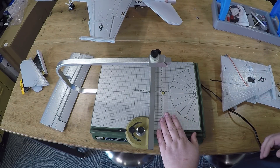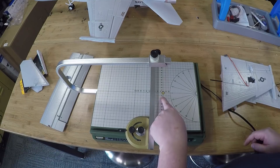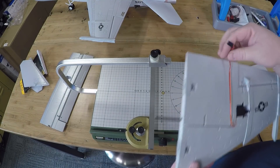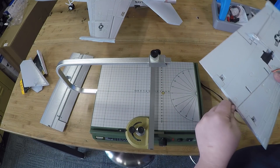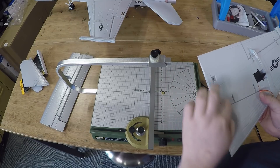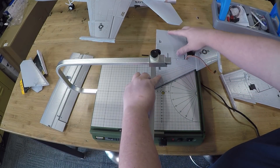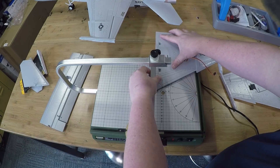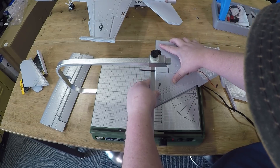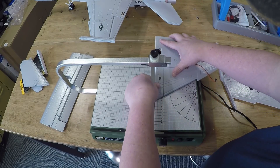The foam cutter is set up running almost exactly 30 millimeters off our center line. I've gone ahead and pulled the servo lead out. The carbon fiber spar is really securely in there — I'm going to use that to my advantage later. We're going to have to do a couple cuts. We'll keep it flat against the fence and just let our carbon fiber rods skirt across the top. There we go — a nice clean cut with nothing on the interior getting in the way.